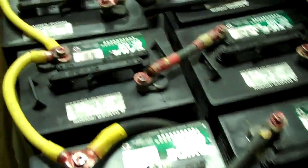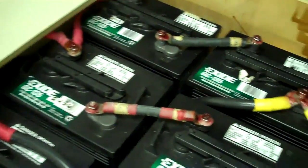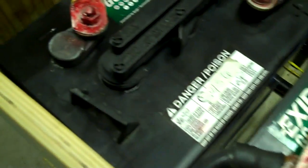I did a video about battery maintenance — the full-blown one. This is just a real quickie. I've been insanely busy lately, and this is basically things you're looking for. This is not an old battery bank but it's got some age on it, though it really doesn't get used much. You're basically looking to make sure everything's dry and looking for corrosion. That's just a spray-on battery terminal conditioner — I believe it's made by CRC. As you can see there, it failed there, so I'm going to pull that off, clean it, spray it, and take care of it. Otherwise I think my battery bank's in good shape.